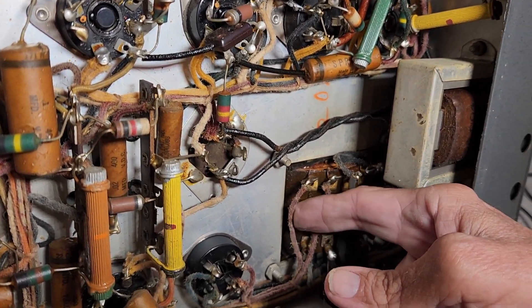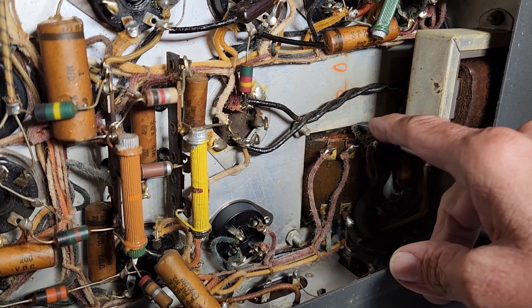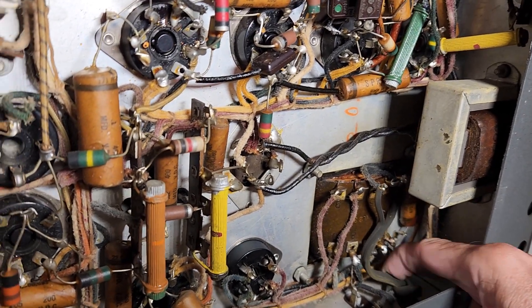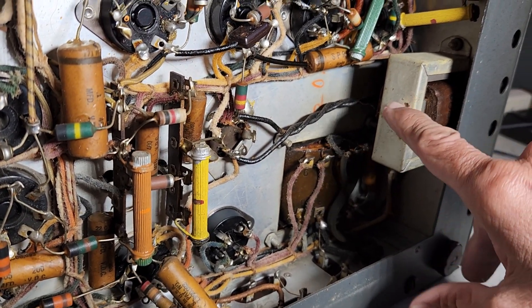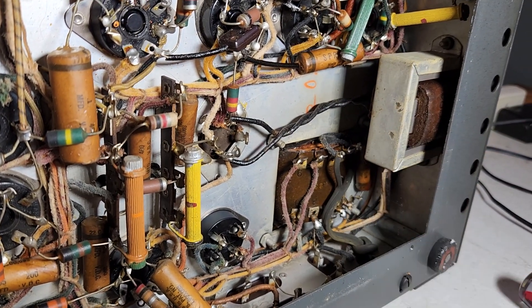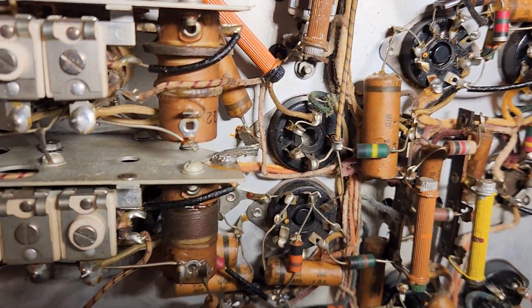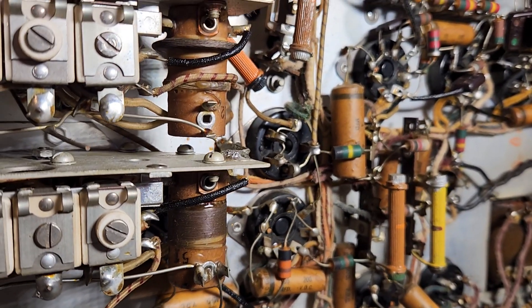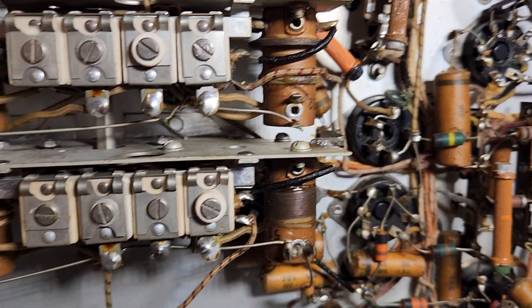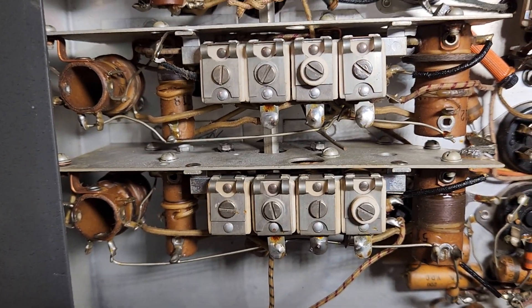The insulation on the transformer wires is not peeling off. The wire is really stiff, but the insulation seems to be okay. That's the power cord — I'm going to have to get behind this transformer to replace it because it disappears back behind there. Looking at the backs of all the vacuum tube sockets, they all look good. I don't see anything broken, no cracks. At first glance, I don't see any broken resistors. I will go through with my multimeter and check the resistance and impedance on all of those resistors, and make sure they're within spec.